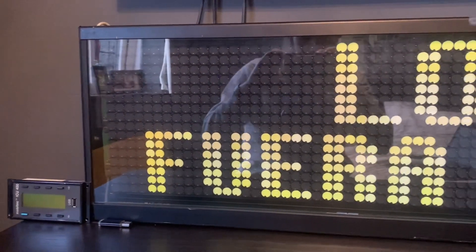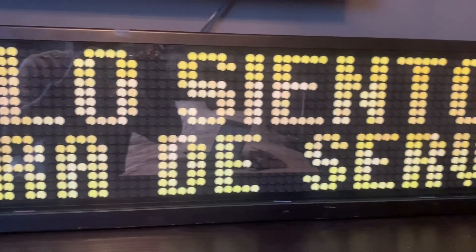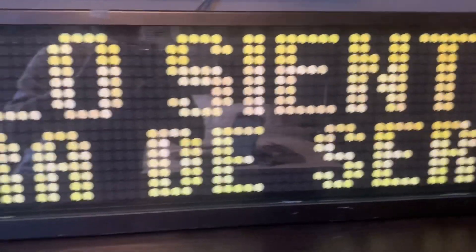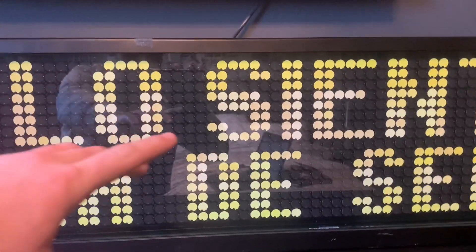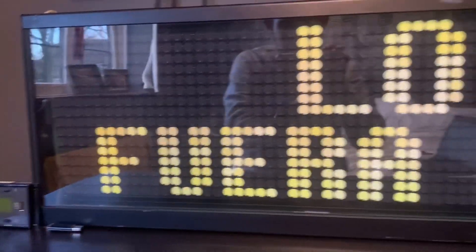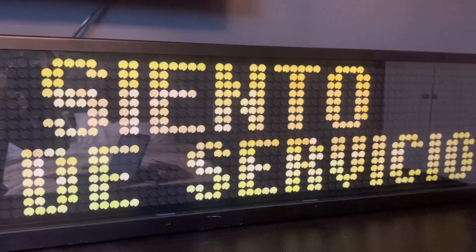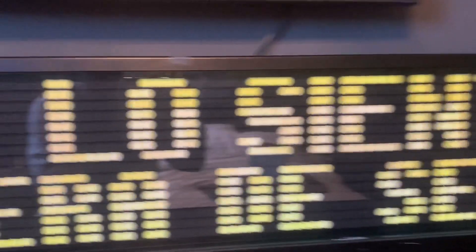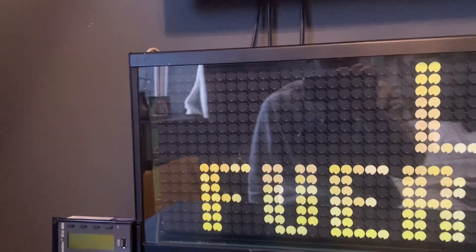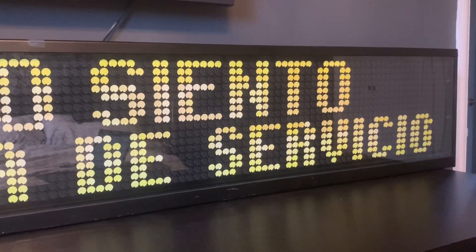The case and general design of these is very similar to the Hanover ones. Unfortunately, my one is suffering a little bit - as you can see, some of the dots in the middle are fading from green to white, roughly around here. Some of them also stick when you change the message; that's just a result of age, it's not been regularly lubricated. Usually when you have a flip dot, it's recommended you use something like WD-40 to keep everything oiled up so none of them get stuck over time.